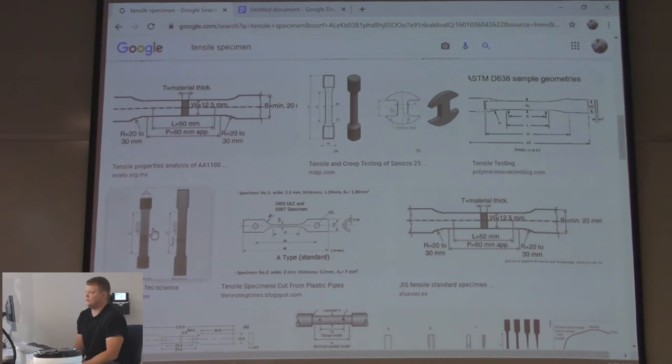If you put in a piece of low carbon steel, it's going to stretch a little bit before it breaks. If you put cast iron in there, it sounds like a shotgun going off. It doesn't stretch at all, and it just goes boom and breaks, and it's a real clean break. The mech tech students will look at and analyze the stretching and the breaks. It's a hard material, right? And the other stretches. It's more ductile.